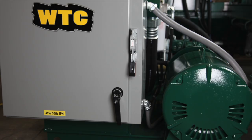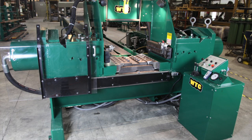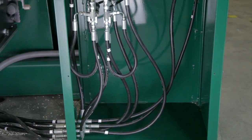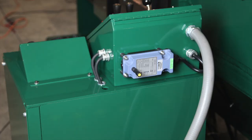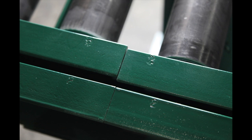Also connect the electrical conduit from the track press to the disconnect enclosure at the back of the power unit, matching the wires to the terminal strip inside the enclosure. Unpack the control console and place it in front of the track press at the right side. Connect the seven small hydraulic hoses from the track press and hydraulic power unit to the bulkhead at the back of the control console, matching the hoses to the fitting tags. Also connect the electrical conduit from the track press to the back of the electrical enclosure on the control console, matching the wires in the conduit to the terminal blocks inside the enclosure.